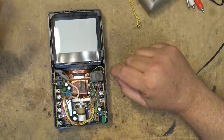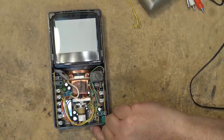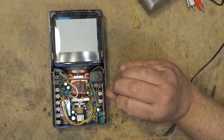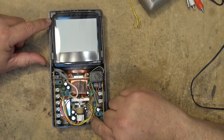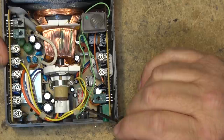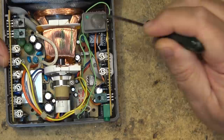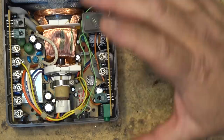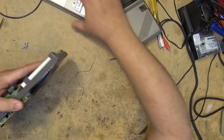What was done: the camera that came with this actually ran on five volts through the four-pin multi connector. When that camera packed it in, I chopped the end off and rewired it to run a little CCD camera that required six volts. I cut the power supply wire right down here and extended it all the way back to the switch, so when turned on there'd be six volts applied to the four-pin multi connector instead of the five volts the old camera used — it wasn't quite enough to run the replacement camera.